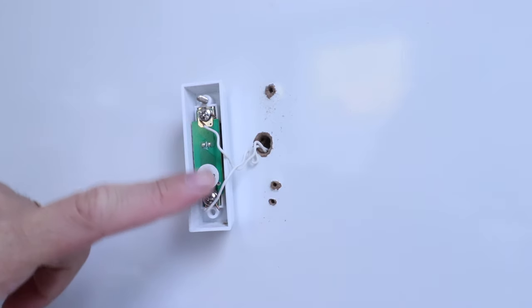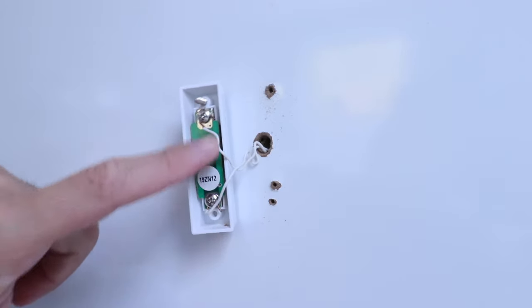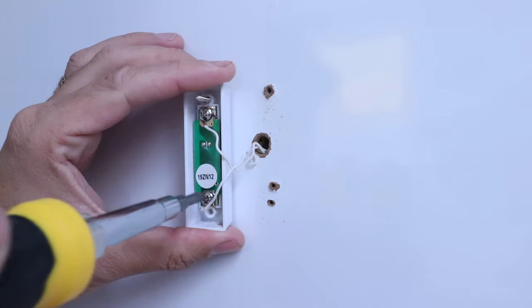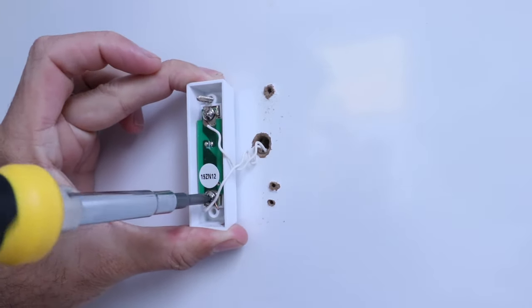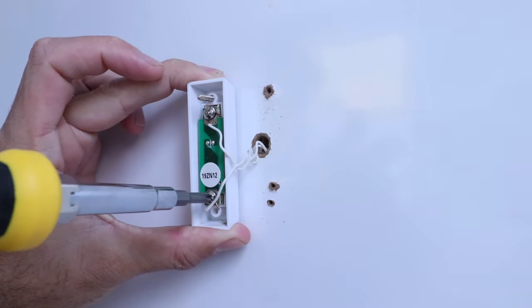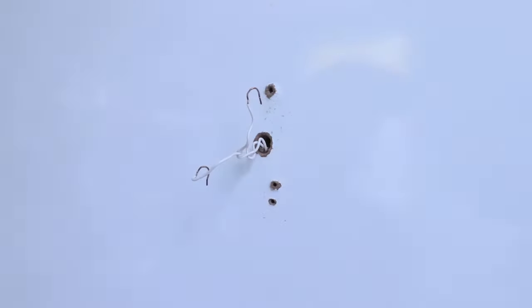You may have a red and white, or both white, or both red wires. It really doesn't matter as long as your existing doorbell was currently working. All you're going to do is remove these two existing wires and then use those to install the new Nest Wired Doorbell. We've got both wires free, which means we're ready to get the new doorbell installed.